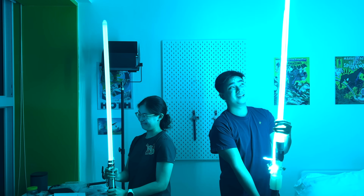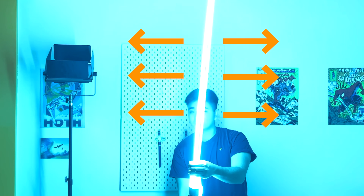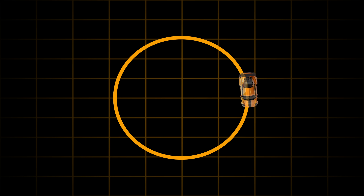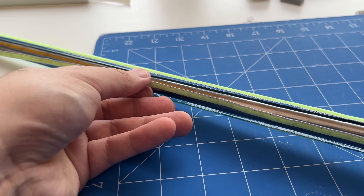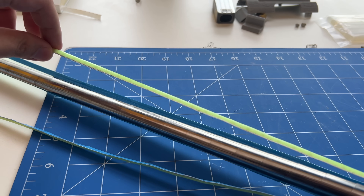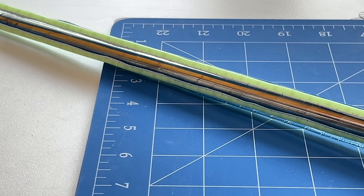In the last video, I verified that the spinning would look good, but we were getting dark lines in the middle of the blade. Why? That's because in those clips, there's no tension on the LED strips. When we spin the blade, there's an apparent outward force that acts on the LED strips called centrifugal force — the same apparent force you feel when you're in a car making a sharp turn. As the blade spins faster, this force increases, and without something pulling the strips tight, they end up looking loose, resulting in gaps between the LED strips and the magician's cane, which show up as dark lines.